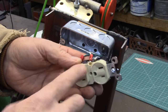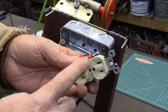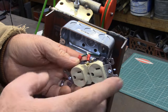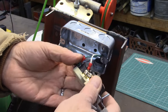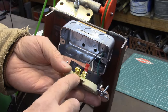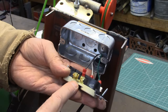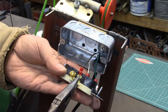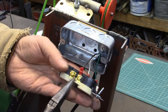You're using 110 or 120 AC voltage, which is enough voltage to kill you, so if you're not confident in what you're doing, you don't need to be doing this. I'm just showing you how these things work. Here's your neutral side and here is your hot side. If you look between this screw and this screw, there's this little brass piece — the line voltage is coming in right here and it goes from this terminal to this one through that little brass piece.